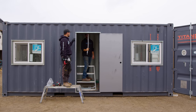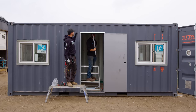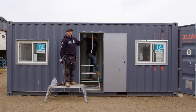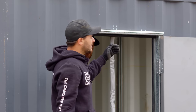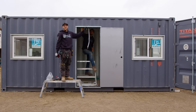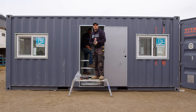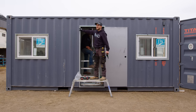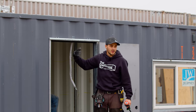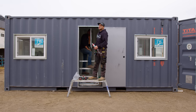We already sealed it up between the side flanges and the container, so we just need to take our sealant and go across the header here. In our previous video we used a top bulb seal for that, but that could potentially allow water to come through. A lot of people ask where the top bulb seal is — we actually don't agree with it after thinking about it. We just like to cut our hole very straight with a nice line and then seal that with this dowel seal, which is amazing stuff. Also grab some clear sealant for any fold lines on the outside of the header — and if you can see any daylight coming in from the inside, get those as well. On this specific mod we're spray foaming the interior, which is just going to lock all this in anyway.